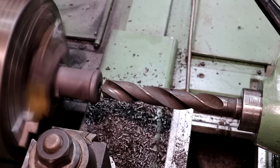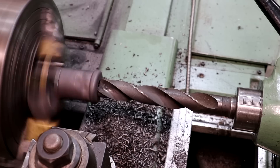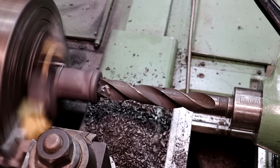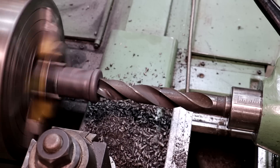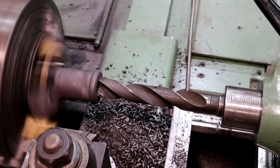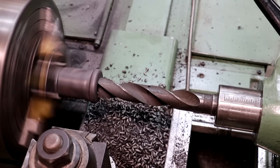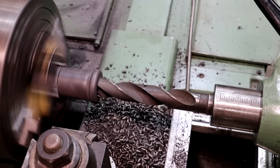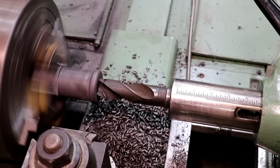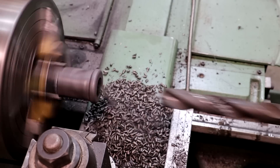We're moving up to the 1 and 5/32nds inch drill bit here. I have slowed my spindle down to about 300 RPMs, which is what this drill bit is rated for. And we're going to feed in - kind of go slow until I get full engagement in there, and then I'll start drilling a little bit faster. You can see it's pulling out a nice chip. Now this hole is going to be kind of a counterbore - it's not going to go all the way to the bottom. We're going to leave about 5/8 of an inch material down in that bottom. I've got a line drawn on the drill bit there which is where I need to stop at. So we're just going to take this on down until we get to that line, and when we get to that line we'll stop. We are approaching the line and we're going to stop right there. That should have our drilling done.